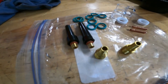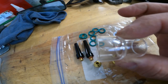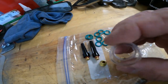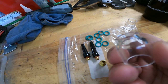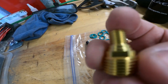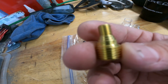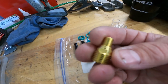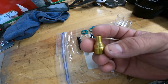These are the products in general — two complete sets. The only difference between the sets is the style of gas lens or the style of cup. This one is a three-quarter inch cup and this one is a half inch, if memory serves me correctly. First impression is that I can't tell the difference between this and the name brand stuff. This adapter, or gas lens adapter, looks exactly like name brand. Both of these are 1/16 inch.